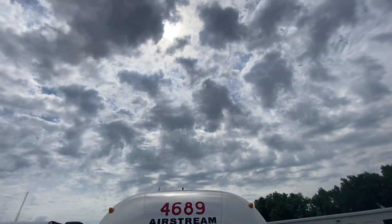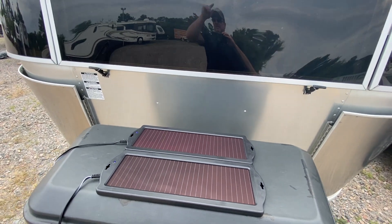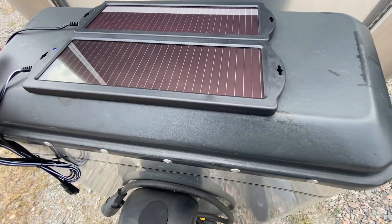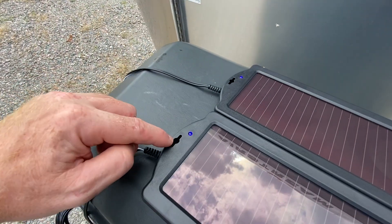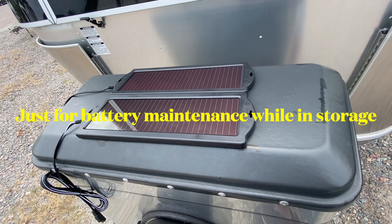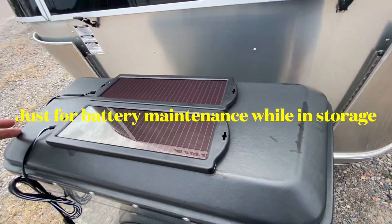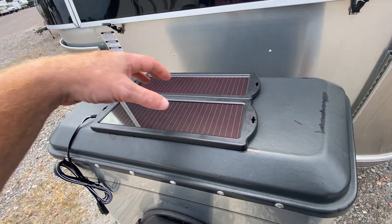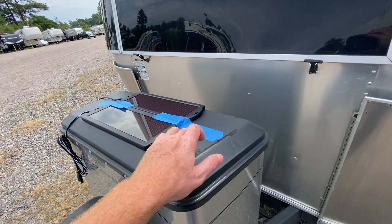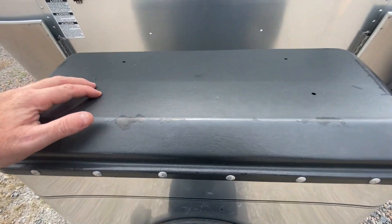It's a pretty cloudy day, but we're still getting a little bit of charge — the sun is up to the northwest and we're still picking up charge. I'll fasten the panels through four holes here, here, here, and here. These are each 1.5 watts, so wired together in parallel they'll be 3 watts total — you wouldn't want to wire them in series. I'm using a little painter's tape to secure them in place so they don't slide while I'm drilling. The holes are all at quarter-inch.